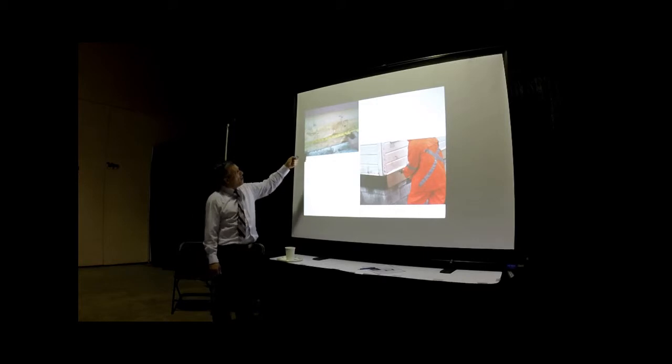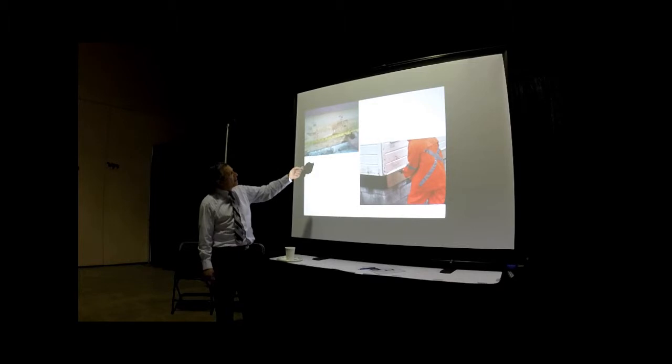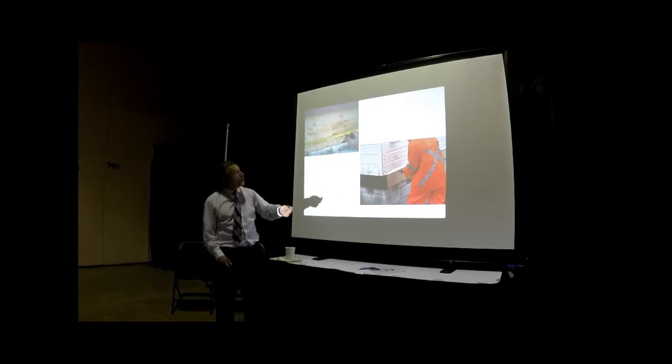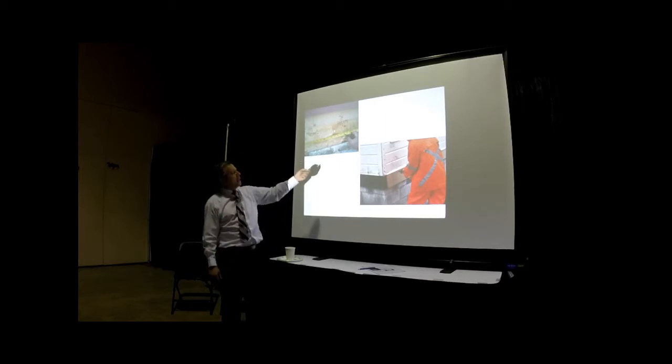Yes. We are not going to leave the OSB exposed to the weather because it's going to be spoiled and become bad and rot. So on the top of that 5/8 thick OSB, we added building paper, like we usually do in walls. And on top of the building paper, we have the typical siding. So the band around the house consists of three layers: the OSB and the nailing, then building paper and insulation, waterproofing, and then the typical siding.